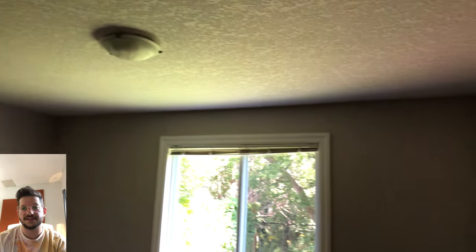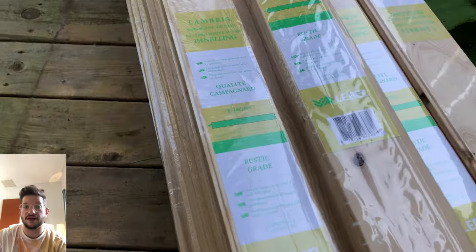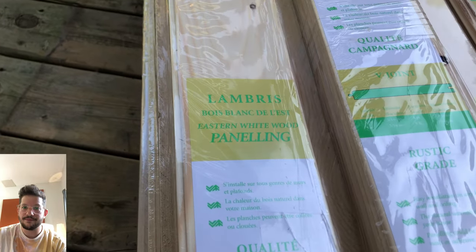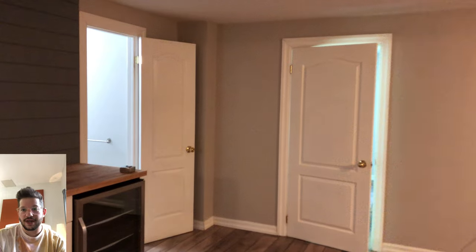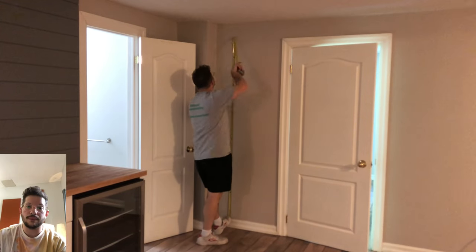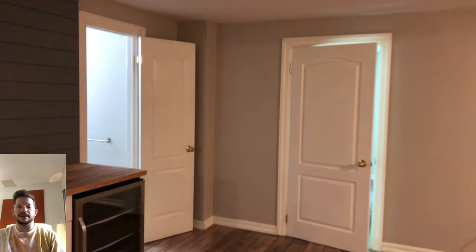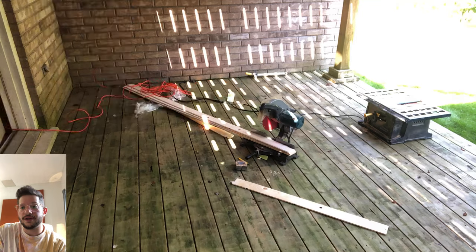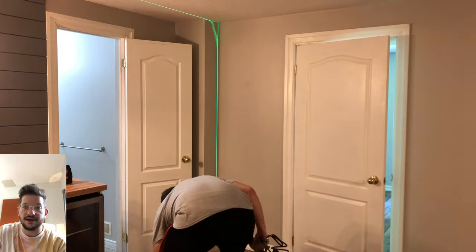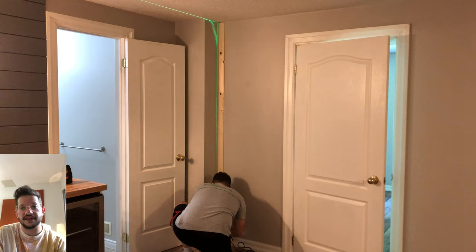Since this client is in a rock band, they are used to performing in studios and rehearsal spaces that have a lot of wood in them, so they are used to that warmer room tone that comes with a wood-heavy room. We are using pine tongue and groove paneling to clad all the walls. This is going to really reduce the drywall surface area in the room and help us add a bit of that wood warm room tone to the space. I'm measuring the distance between the top of the baseboards and the ceiling, leaving about a quarter inch of space to make sure these nail in easily, since we are going to trim and add custom lighting where these panels meet the ceiling. It's not important that the board touches the ceiling — a little space there makes the installation process a lot easier.